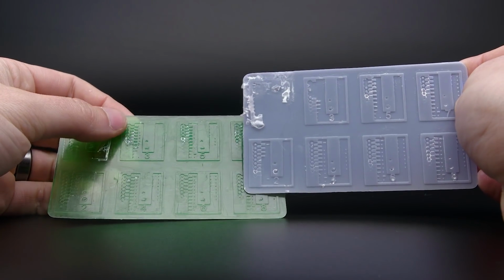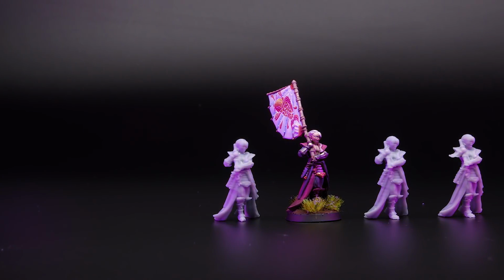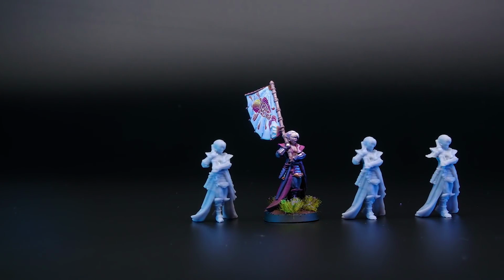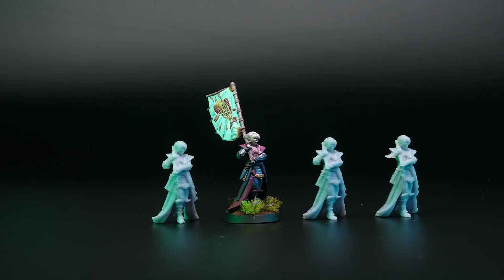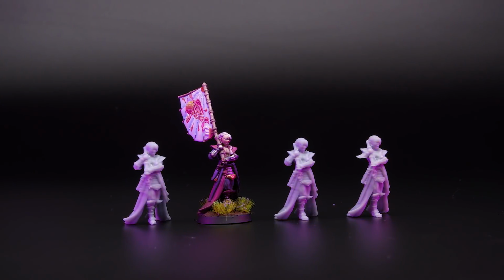Well then you have to resort to the numbers that other people have figured out and then modify them from there based on the results you're seeing. Resin is fairly cheap, so try printing the same model with the same support 3 different times, increasing or decreasing your exposure by 1 second and comparing your results to find out what works best for you. Basically, you want as little exposure as needed before you start getting printing failures. Okay, that's the exposure settings figured out. Either you have access to a nifty resin exposure rangefinder test, or you can print the same model back to back, dialing in what settings work for you.